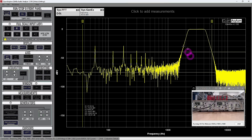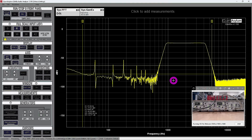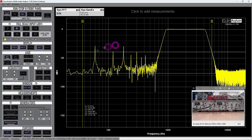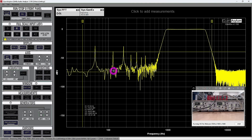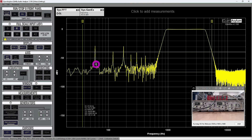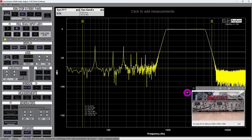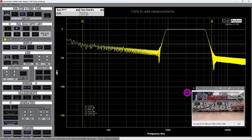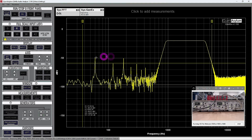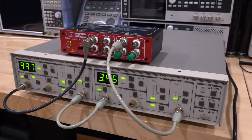Going to a much lower frequency — it works and the passband is very flat. Unfortunately we're still picking up a lot of mains noise. There must be a way to get rid of this — probably an AC line filter is needed for the lab. But I'm reasonably confident the whole thing is working. Lowering the gain shows the entire curve going down with it — including the noise tones, confirming they're being amplified by the internal filters — but overall it looks good.